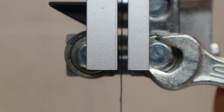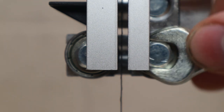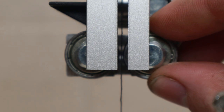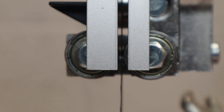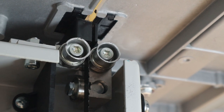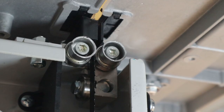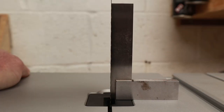Then it's on to the side adjustment of the side guides. Again you need to move the bearings as close to the blade as possible but without touching it. The idea is to keep the back of the blade from fishtailing as you cut - mine need to go in a little bit more. Don't forget you need to repeat all of these steps we've just done on the top guides onto the bottom guides as well. A quick check of the squareness of the table to the blade and we're ready to make our first cut.